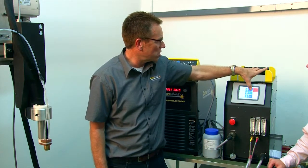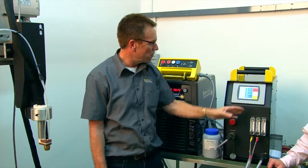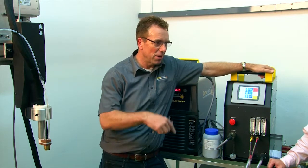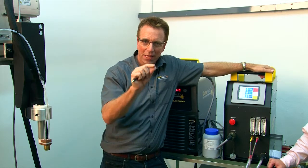There will be some occasions when you set it to semi-automatic. The semi-automatic setting enables you to turn the powder feed on and off independently. For instance, you could be halfway through a weld and turn the powder on when a gap in the weld comes, then turn the powder feed off when that section has been completed.